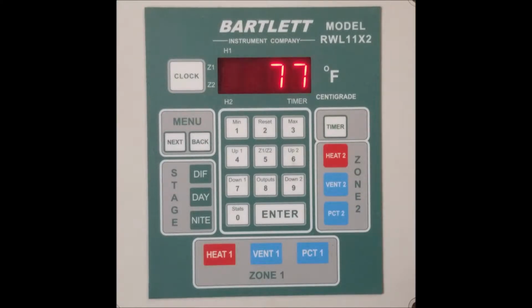For more comfortable working conditions, or if an emergency situation develops, any output may be turned on manually, say, to turn on your proportional outputs for 20 minutes while you work in the greenhouse. The video will cover how to manually override your heats and proportional outputs, as well as set the on-to-auto timer for automatically switching those outputs back to automatic mode.